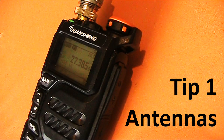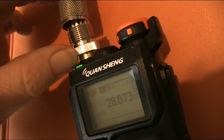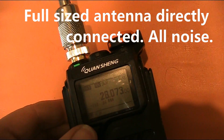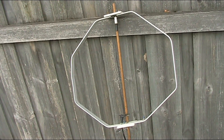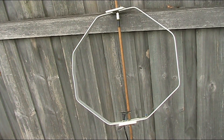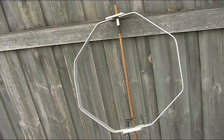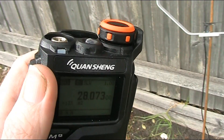You could even use a home station antenna, though bear in mind there may be issues with RF overload. Right now I've got the HF multiband antenna — a full sized antenna. We also have this magnetic loop which covers about 21 to over 50 megahertz. It's a narrow band antenna which should make it a perfect companion for a receiver like this that has a wide band front end.